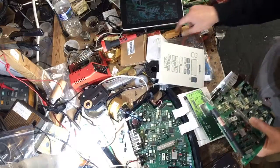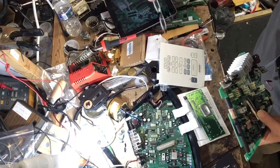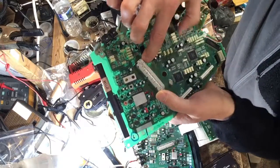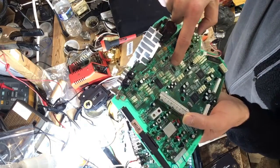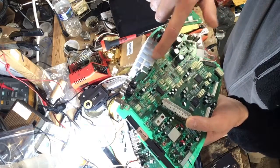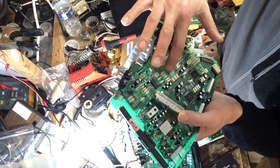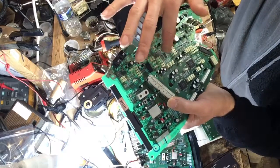I believe it's, let me get my glasses. Hang on a second, guys. Okay, this is C650 right over here, and by replacing that one I was able to get my audio into this chip to get it to go to U1, which is the output stage. The quad op amp over here wasn't receiving audio, so replacing this resolved that issue.